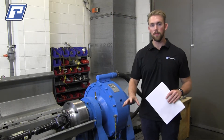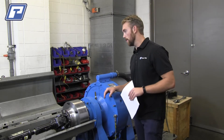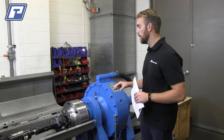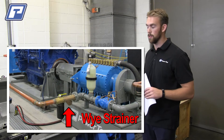For our three month maintenance, you're going to want to perform everything we've outlined in the monthly maintenance setup. In addition, we're going to do a couple of additional tasks. The first thing — we want to look at the dyno water supply and see if you have a Y-strainer equipped. If you do, you're going to want to clean it out for any particles that have accumulated in the prior three months of use.